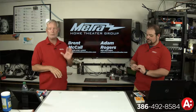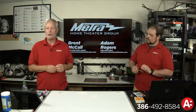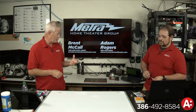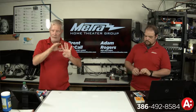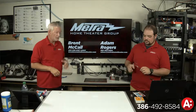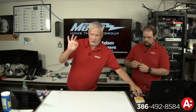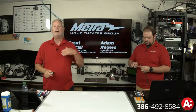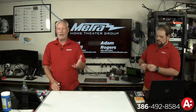The big change between HDMI 2.0 and 2.1 is how the data is transmitted. It is no longer going to be a separate red, green, blue feed and clock. It is now going to be aggregate feeds. So you're going to have the same 4 channels, but each of those channels is going to get its bandwidth capable combination of red, green, blue, and clock. Now, for retailers, this is a godsend. Because when you have the 3 channels that are all independent, and there's a failure in any one of those cables or in the hardware on one of those channels, the system collapses. You take it back to the retailer, and they got to deal with you, and then they got to go to the manufacturer.